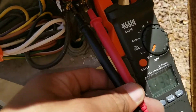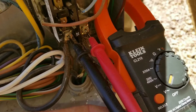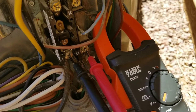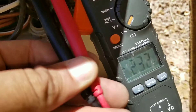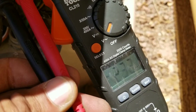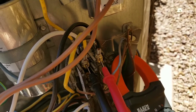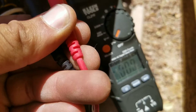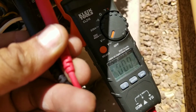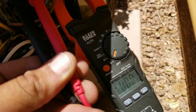I have my multimeter set to voltage AC. Checking the voltage coming from my disconnect, and I do have 240 volts. Now I'm taking my leads and putting them on the top — this will be outgoing voltage — and you can see that I do not have voltage going out even though my contactor is engaged.